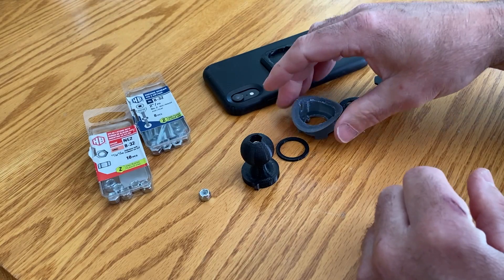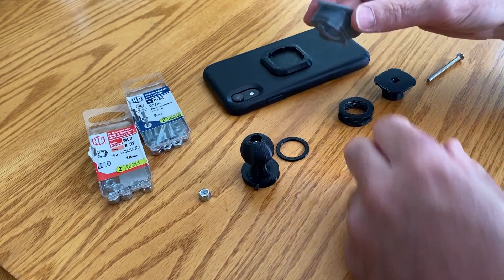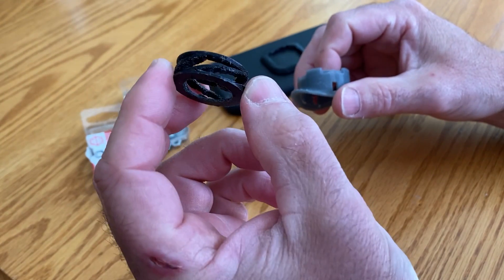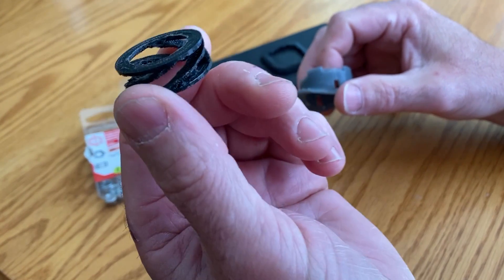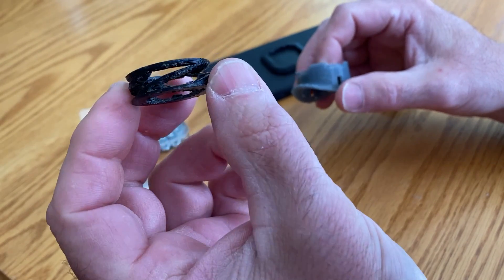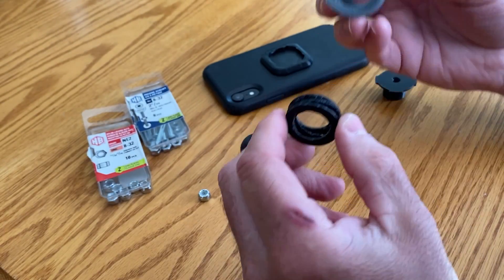The rest I've left virtually unchanged — I think it's a great design. I used PLA plastic for everything. There is a caveat in the original design that the spring may break down because PLA doesn't work well under load, but so far so good — it seems to be fine.